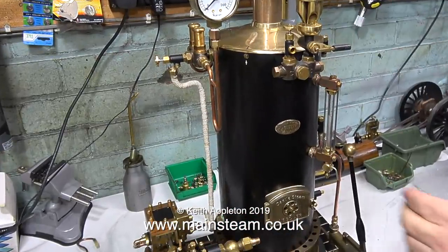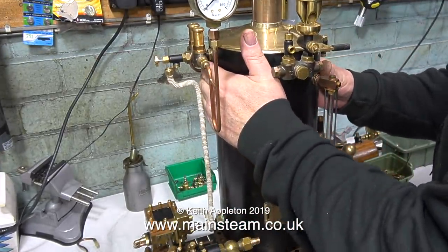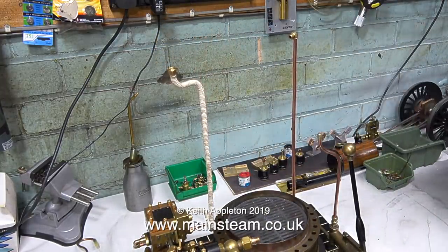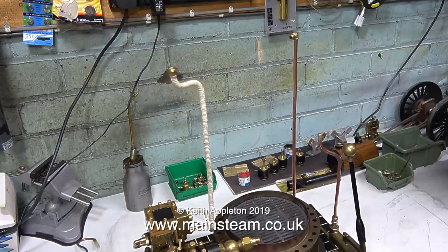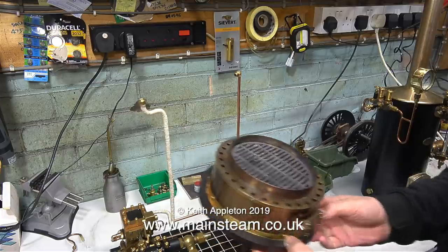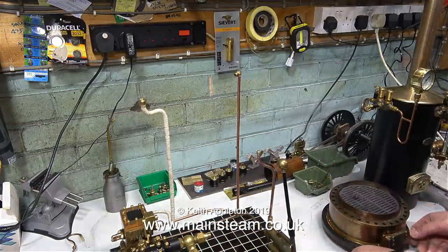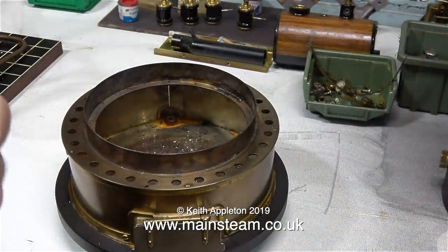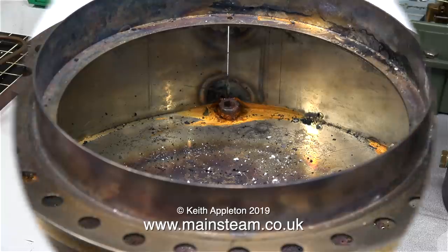The design of this boiler is very well thought out. It just sits on the ashpan and all you do is disconnect the piping and lift the entire boiler off the ashpan. This allows for quick and easy cleaning out of the ashpan after a run on coal. Being able to quickly lift the boiler off the ashpan is also a good idea should the water inadvertently run low.